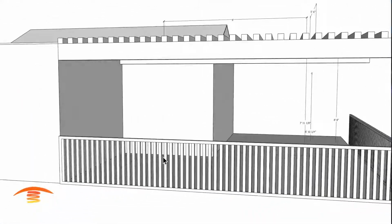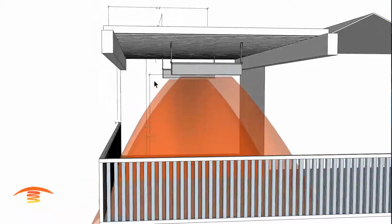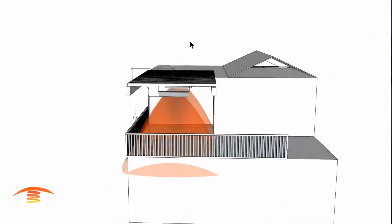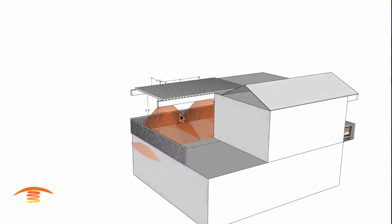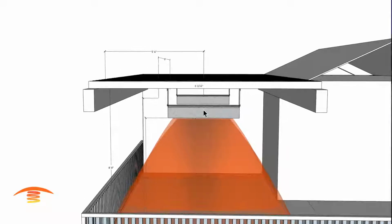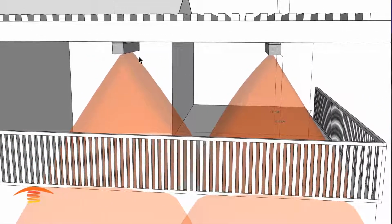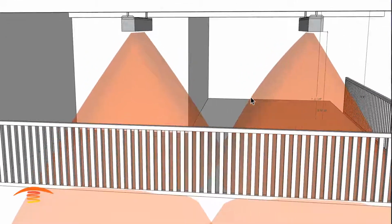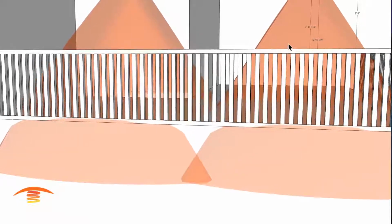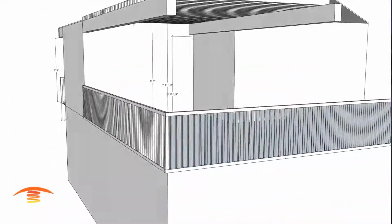So let's go back over here. There's two different options that we can use here. That option would be a gas heater, and as you can see, the gas heater's elevation would end up being 6 foot 10 inches off the ground, which is rather low for this model. Also, I did state that this is a beach application and you have a predominant wind coming through this direction. Gas heaters don't work as well when it's windy, so that's something to be concerned about. Also, I have this heater centered in the patio and 9 foot centered throughout the span. You can move them left to right or closer to the house or further away depending on how you would like that. But again, I'm still not happy with this. You can see the heat footprint really requires the heater to be higher up off the ground to really produce a good footprint of heat. So let's turn that off and we'll look at the electric options.